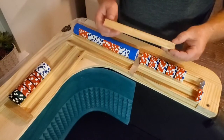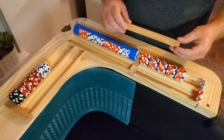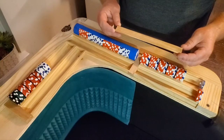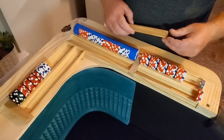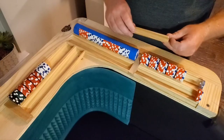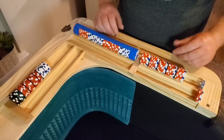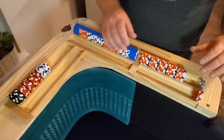This is just pine, unfinished pine. What we're going to do is cut it on a miter saw. If you don't have a miter saw, you can probably make a jig for your circular saw, or just borrow one from a friend. You really want to use a miter saw because these cuts need to be pretty well fitted — that's the best way to make sure you get nice straight cuts.